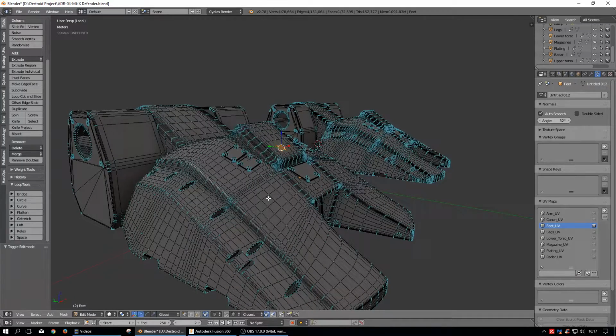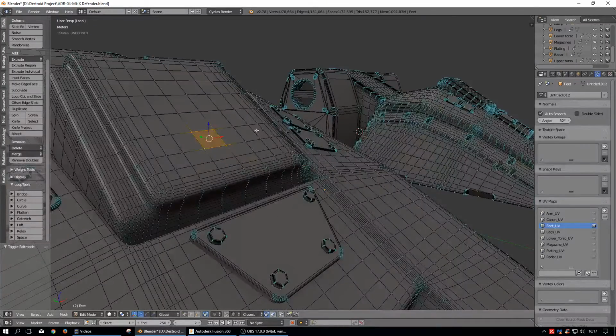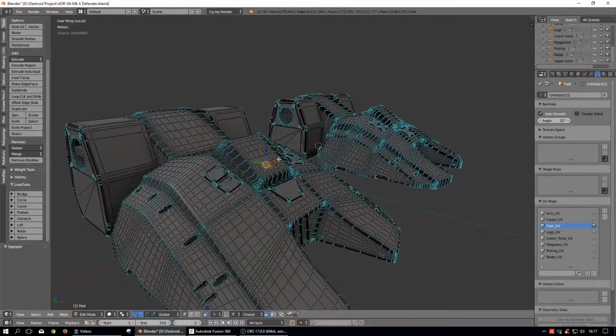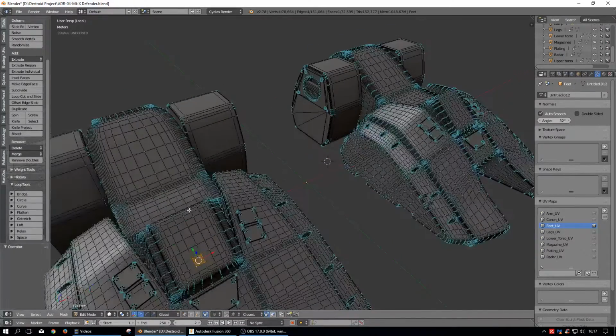Now, I don't actually draw every one of those individually to make this thing. There's different types of modeling methods that can be used. But when you get to this point and you're freezing, what we call freezing the mesh, it gets to be really hard to edit, because when you move stuff around, you'd have to move a whole bunch of stuff, and it gets to be really unforgiving. And even though I could have designed this stuff totally in here, the accuracy that I get out of it isn't all that great. And I don't really have a parametric modeling system. So what does that mean?